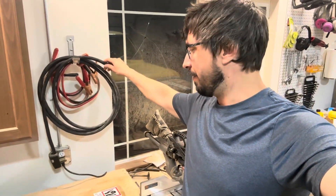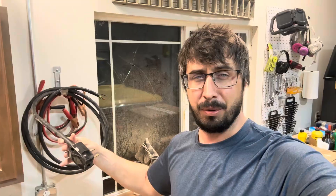The last thing you're probably going to say is: why didn't you just keep the side with the longer wire and put a different plug on that end? I guess I could have done that, and honestly I probably will, but I just wanted to see if this could be done. I had to learn a bit about 240 power, talked to a couple electricians — basically, you don't need the neutral wire. EVs and stoves want the neutral, but most welders and plasma cutters just don't care about the neutral, so just make sure it's capped off well.